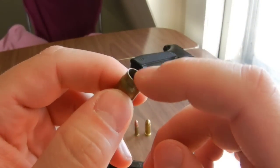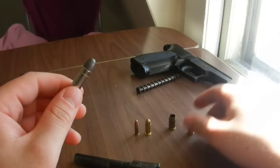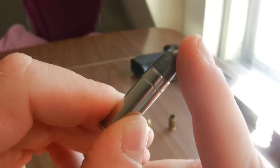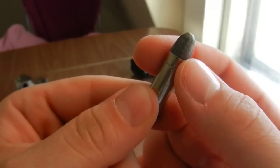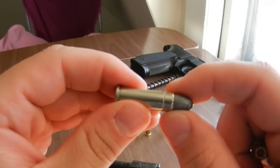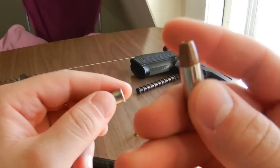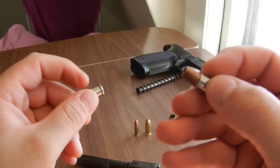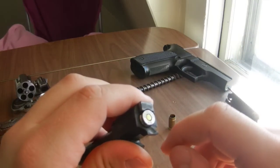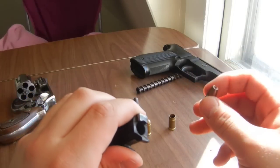Even on these ones, the headspacing is done on the case mouth. Another interesting thing you'll notice is if you look at the revolver round, you'll see that the case kind of tapers inward as it crimps onto the bullet — that's called crimp, and the case mouth is kind of turned inward onto the bullet. The only reason that works for a revolver is because the revolver headspaces off the rim. If you roll-crimped an auto pistol cartridge, it wouldn't have any place to headspace inside the barrel, and the bullet could go further into the chamber than you want. So that's basically the difference between an auto pistol cartridge and a revolver cartridge.